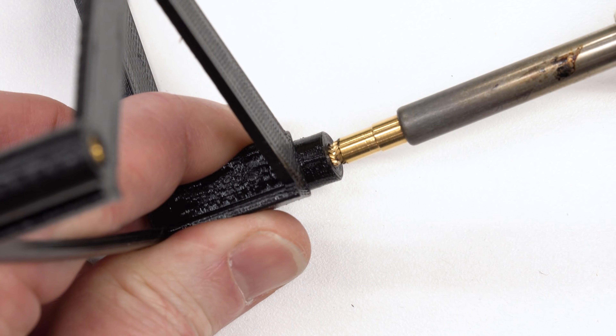That just could not be simpler. Now, if you look around YouTube, you will find a bunch of people that have made more complex jigs for doing this. One of the things I've seen is a lot of concern about the threaded inserts going in straight, so people have made what are essentially small presses or modified small drill presses to hold a soldering iron to come down and press these in straight. In my experience, just playing with this a little bit, I don't find that to be necessary. I've been able to just press these in straight — or straight enough.